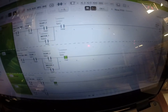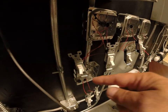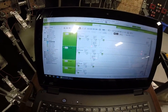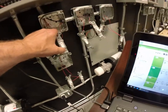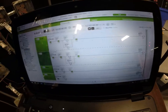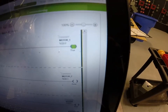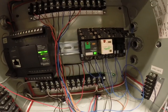You're seeing them work in the field. I'll turn overload one off and then back on — I need this circuit to work. My selector switch is my first switch, so now you see all those on. I'm going to pretend there's water coming in the basement and hit float switch number one — you can see it work. Remember, it doesn't turn on a motor coil or anything at this point. Float switch number two gets turned on, we get motor one running, and you can see I have a coil simulating a motor — see all my inputs on my PLC working too.